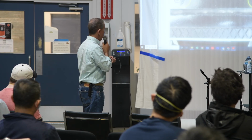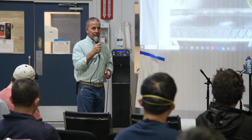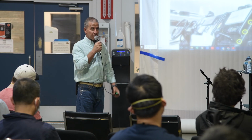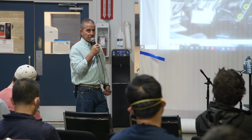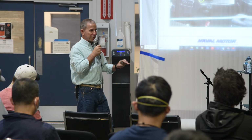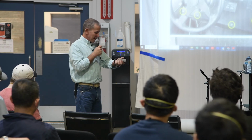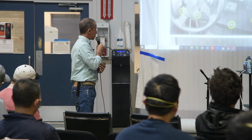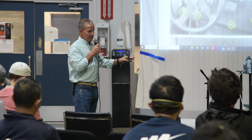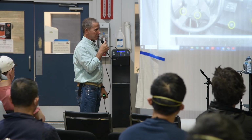And I see you've got the diamond pattern deck material there. That actually looks like it's holding up quite well, but if you have an adhesion failure and water gets under it on an aluminum deck, it's really a nightmare. So make sure that material is really well adhered, that the surface is really well prepped, and there's no contamination, no fingerprints, no oil. Surface prep is really critical for that. That's an adhesion issue between a deck material and paint. It's not an aluminum issue. That becomes a painted surface issue.